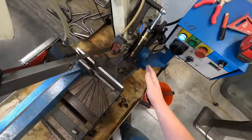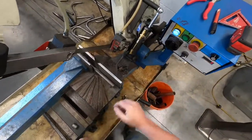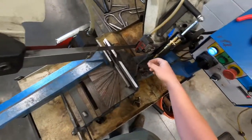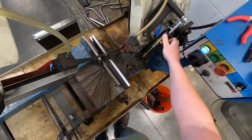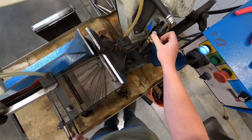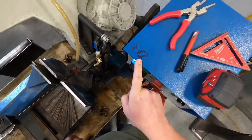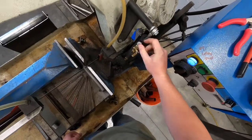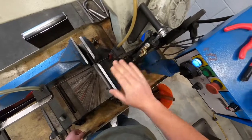Now we have our hydraulics. This is what actually lowers the cutting arm. It's got a hydraulic lever and you can adjust the rate at which it drops. I've got it written on top of the control panel: number four cutting speed. That means we'll dial this into number four — you'll see a little white tick mark there — and then you shouldn't ever have to touch that.